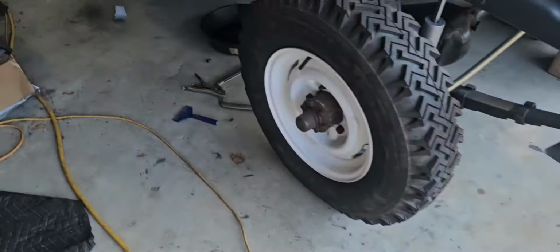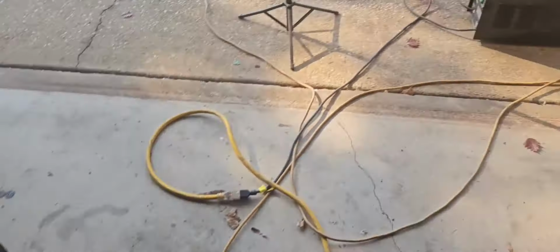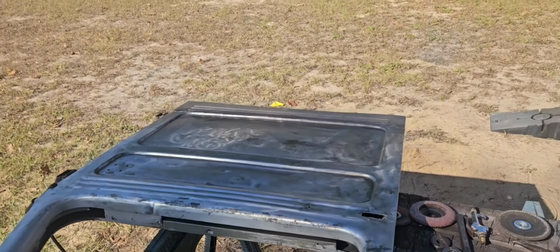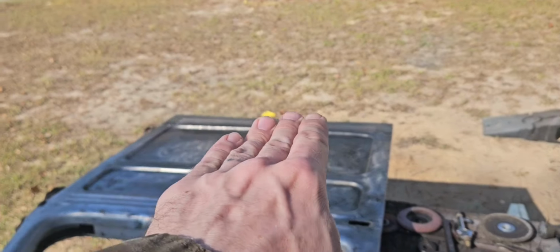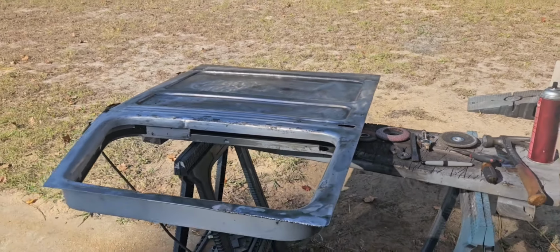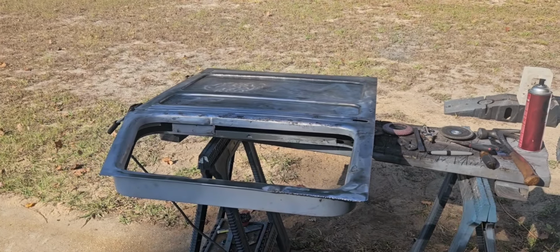And it actually makes contact with the rocker when I close it. You can see where it hits right there in the middle. So that's what's holding me up on a good, nice, clean close. So I'll try to take that little bend out of it and straighten that out. And then this door should close nice and straight. And then I'll move on to the next one.